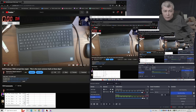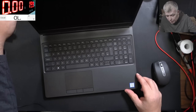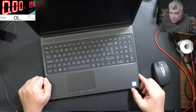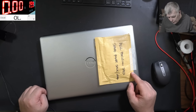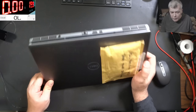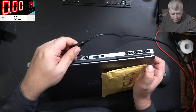The laptop worked fine and the customer used it, but the customer is saying he left the laptop for a while and it died — same like before. He said it had some light. I told him to remove the battery, remove the BIOS battery, leave it, then try again. When he tried again it was just dead — no light at all. Anyway, he sent me a jack spare part, but clearly his charging board is fine. Let's plug a charger and see what it's doing.